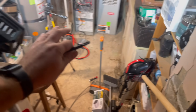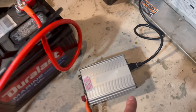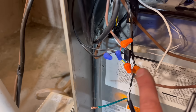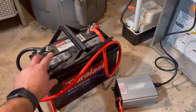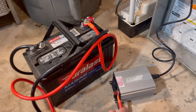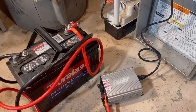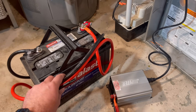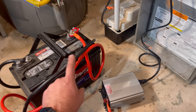Now, just so you guys know, I'm not doing some funky business. I'm going to show you behind the scenes here. We've got our battery hooked up to our inverter, green LED is on, to our pigtail — straight into the furnace — and our power is still disconnected here. I got this battery from our camper. A lot of you guys have campers yourself, so you can rob the battery out of that in case of an emergency. And worst case scenario, just purchase one of these if you want to be proactive and keep it down here in the basement, wherever your furnace is. And don't forget that you have to get these separate — when you buy the inverter, it does not come with these. I bought them separate; it's in the same aisle. Or if you get this on Amazon, make sure that you pick up these.